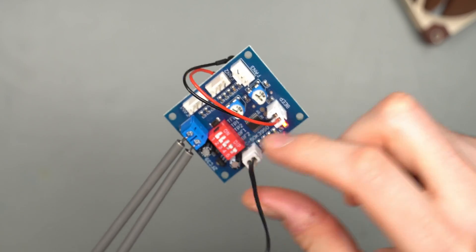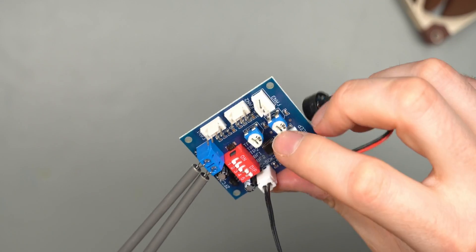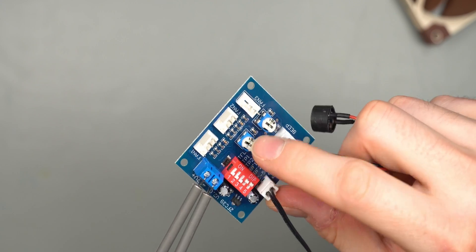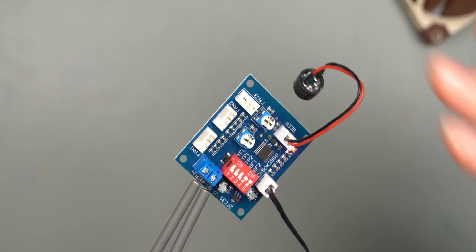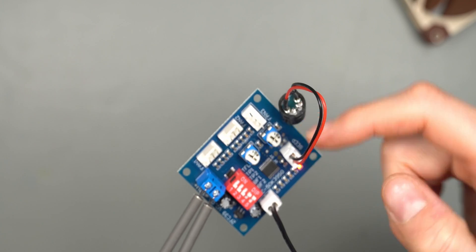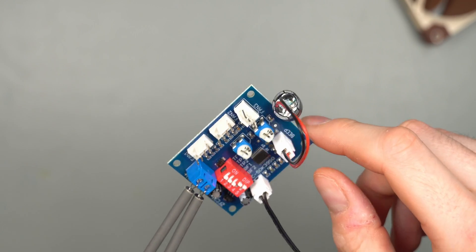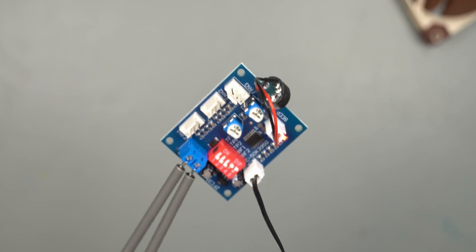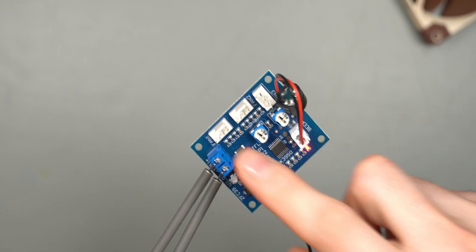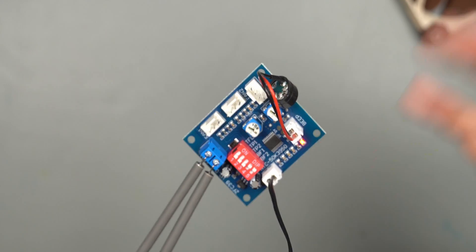Other than the beeper issue, I really like this one - it's very simple, no complex button combinations to remember. You just need to remember the dip switch settings and save the instructions. You can dial in the fan RPM using the two adjustable screws for fan one and fan two minimum speed. Fan three is not controlled by the adjustable screws, but fans one and two are definitely temperature-controllable, making this the one I'll most likely end up using.